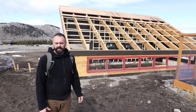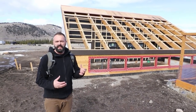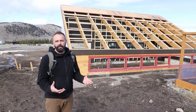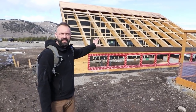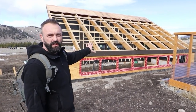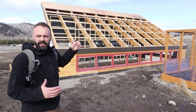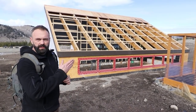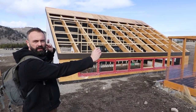Today I want to give you a tour. It's not done yet, which is a great opportunity for you guys to see some of the inner workings of the greenhouse before everything gets clad up and set in motion. The front part here is the passive solar greenhouse, and you can see that we've got the glazing surface, consisting of rafters which are going vertically up and purlins which are going horizontally across.